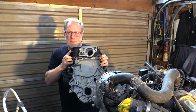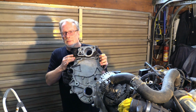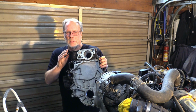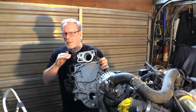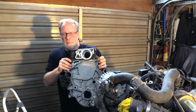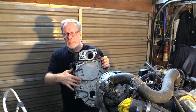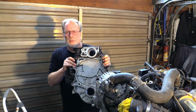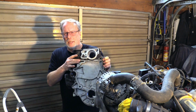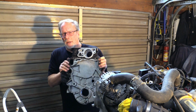And one of the reasons, there's a good handful of reasons, but one of the reasons why at idle, when you start up your 7.3 and it gets warmed up and the idle goes up and down and up and down, I'm just talking 50 RPMs, up and down, up and down, not the glug, glug, glug. That's an IPR thing, ICP thing, cam sensor. But right here, you get a little bit of air in there and then it starts leaking down. Your high pressure oil pump reserve doesn't get full to the top like it should. And like I said, once again, air gets in here, idle up, idle down. It's crucial that you get brand new bolts.